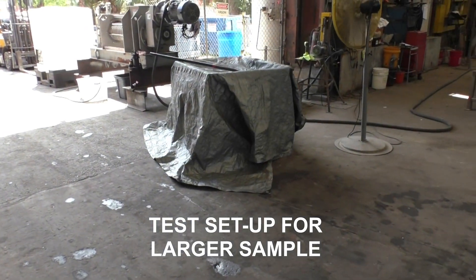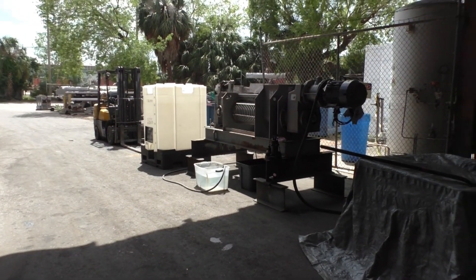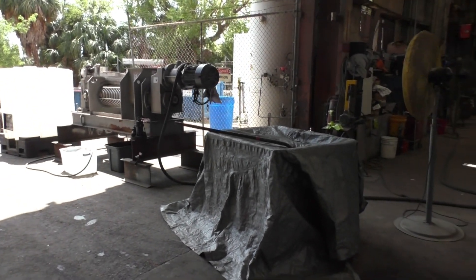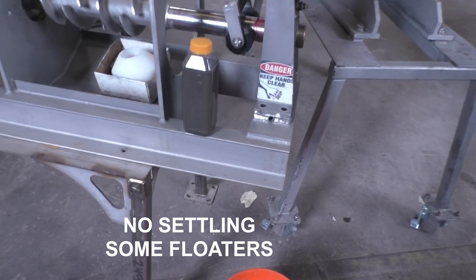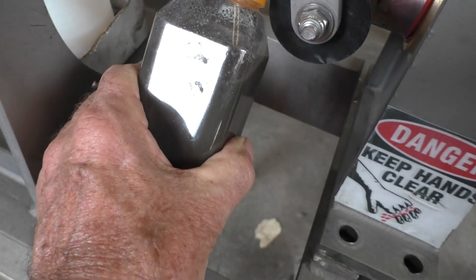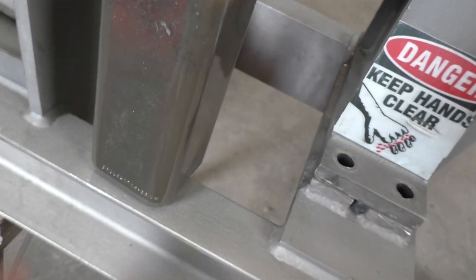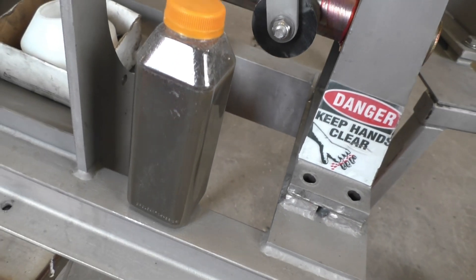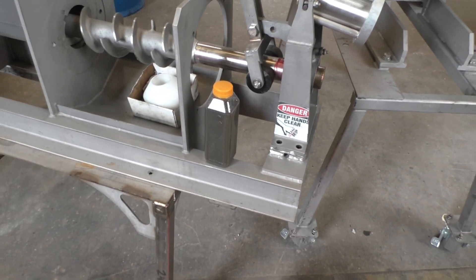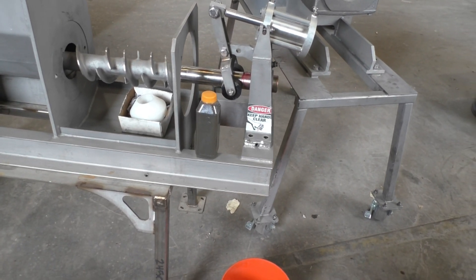I need to add this: here is everything set up for a test that's going to be run tomorrow morning. We don't charge for testing, and the engineer on this project got a bigger sample. So far our sample doesn't show any sign of settling out. Looks like there may be a little layer of something floating on the top — yes, something floating there. Looks like the fines that were in the material we pressed were forced through that screen even though it has a narrow slot width. Looks like you can float it out using gravity decantation — put it in a tank and let the overflow carry it away.